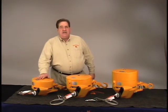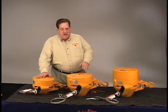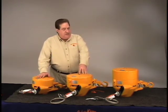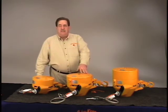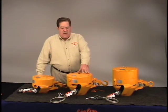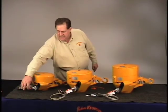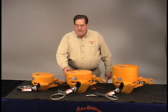They're all the same design as the Model 7241. The only differences are that the cable drum on the 51, 51 double, and 61 all hold 10 feet of cable for cable travel. That dictates that the spring be larger, the housing be larger, and that it will hold heavier weights. The cable assembly is identical to the cable assembly of the 7241, except that it's 3.5 feet longer.